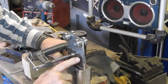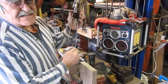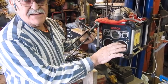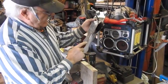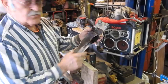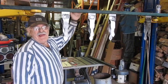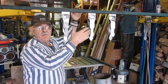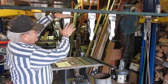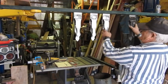I'm going to drill press and drill this, go ahead and put a bolt in here and then be right back. If you're wondering why there are two different sizes, that's because without a CNC table this is all freehand, and I needed to make two different sizes so I can keep the four identical on one side and then the four other ones on the other side — because I've got eight individual parts and didn't have to think about it during assembly as to which ones go how they orient. The Unistrut is going to be painted black as well and it's going to be recessed — completely out of sight — all the way down to right about here. All you're going to see will be the door and the hardware sliding back and forth, so this will be one door and this will be the other door.